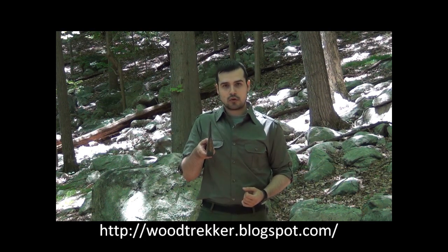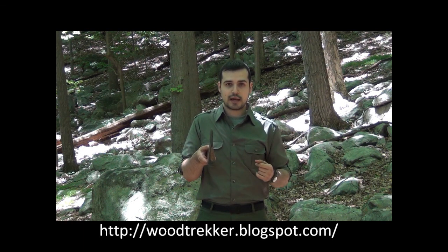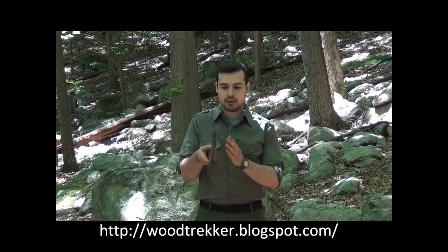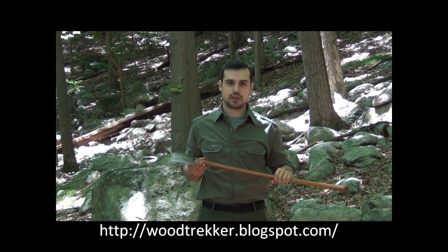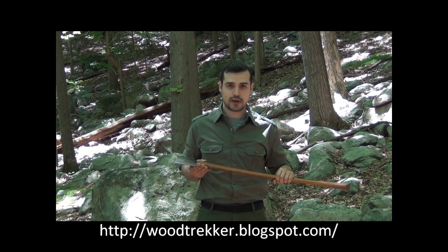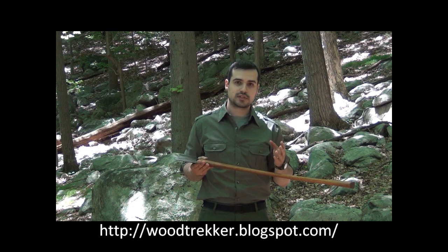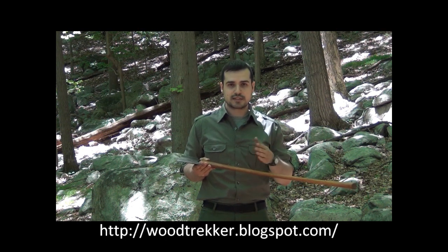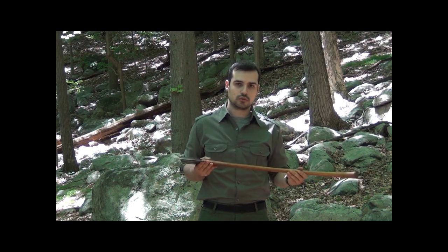The eye is still very narrow with smooth continuous cheeks, which allows for a great chopping axe, as well as splitting, allowing the head to pass cleanly through the wood. Clearly, all the features we see here existed on the American felling axe. There are many minor characteristics which could distinguish one axe from another and establish minor milestones, but they all go beyond an introduction to axes.